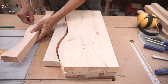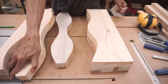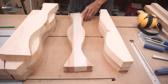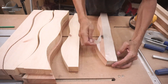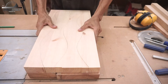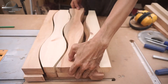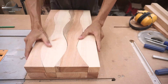The next step is to remove the double tape and masking tape, then switch the position of the wood — swapping the pine wood and the mahogany. Just switch them like so. You'll get a different color and contrast, and after this we're going to make the inlay using the jackfruit wood.